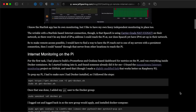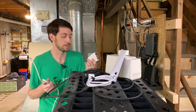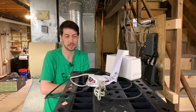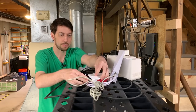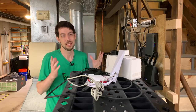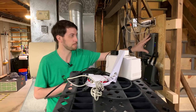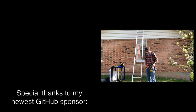I'm also plugging in a Raspberry Pi 4 with my internet monitoring setup on it. I have a blog post in the description about how to set this up, and I'll probably do a future video on setting up your own internet monitoring Pi along with Pi Hole. I'm plugging that into the Pi's Ethernet port — if you're measuring speed performance you definitely want to use a wired jack and not wireless. This is supposed to be a temporary setup. I'm going to start monitoring Starlink's connection — testing YouTube streaming, file uploads, cloud backups — and compare it to my cable internet.